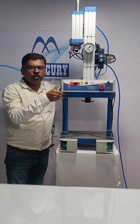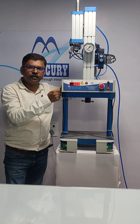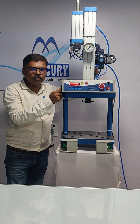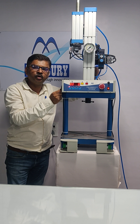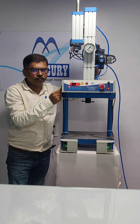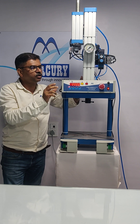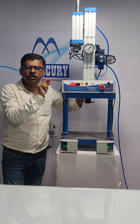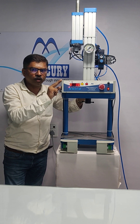The moisture accumulated at the filter of your FRL needs to be cleaned or drained on a daily basis or at regular intervals. It is better to install a good auto drain valve for that. The FRL lubricator needs to be set such that every 25 strokes of the machine, only one drop of oil enters the air supply.